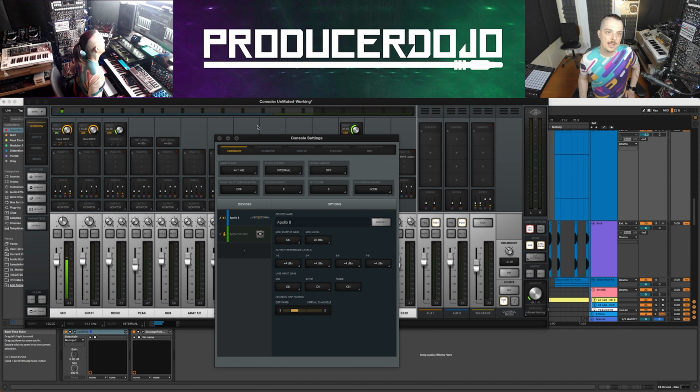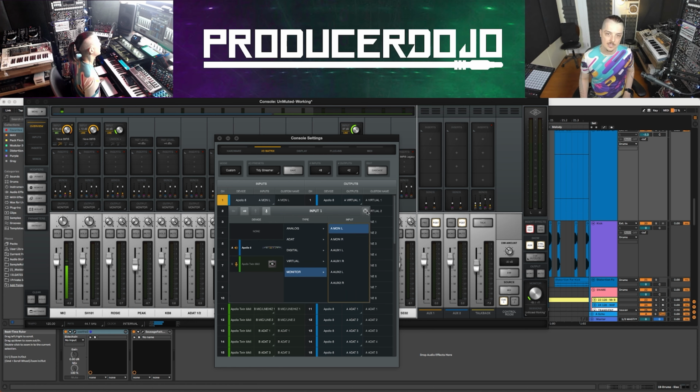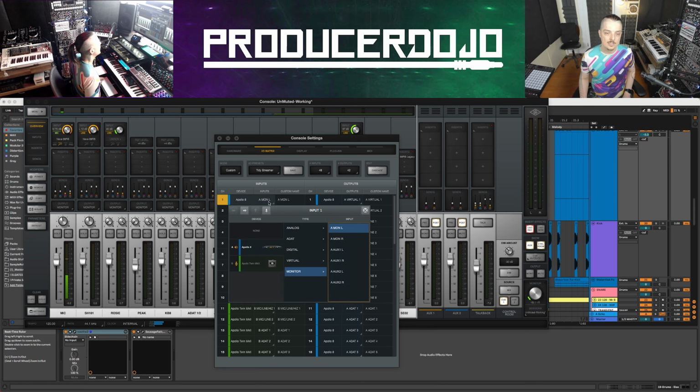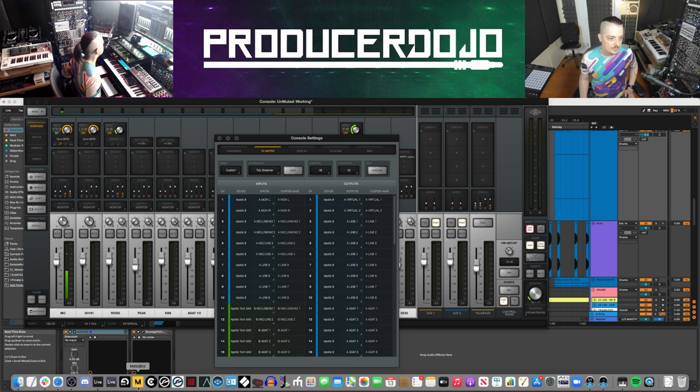Then if you go to the IO or input output matrix, you can route the audio from your monitor mix coming out of console into inputs 1 and 2. You do that here by selecting monitor and then selecting monitor L and monitor R for channels 1 and 2 respectively. This means that your whole monitor mix is coming through to your software, which is very important